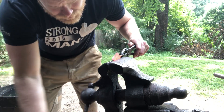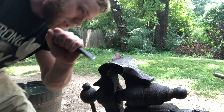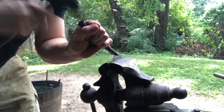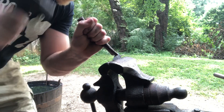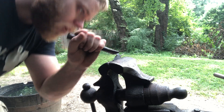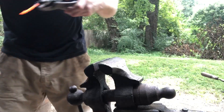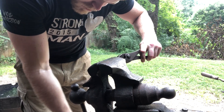Another thing I like to do with my leaves, before I do the final shaping, is chuck them up in the vise, take a chisel, and go in at the end of those veins I made and just cut into the leaf about a quarter inch or so. I'll do that on both sides — you'll see why here in a minute.